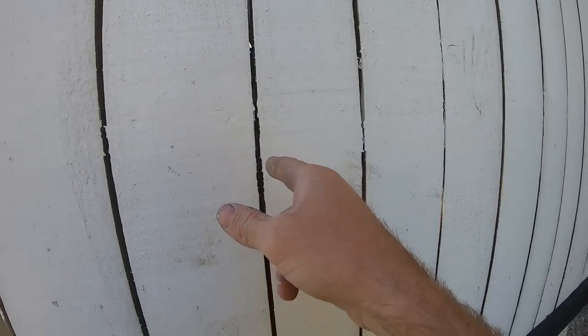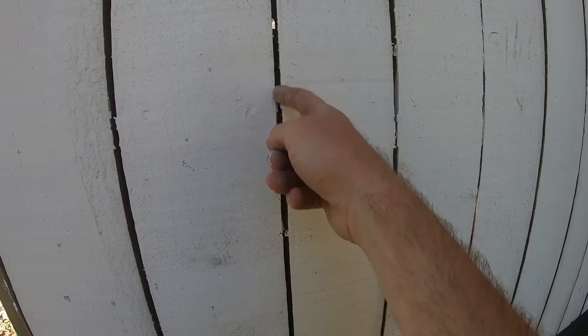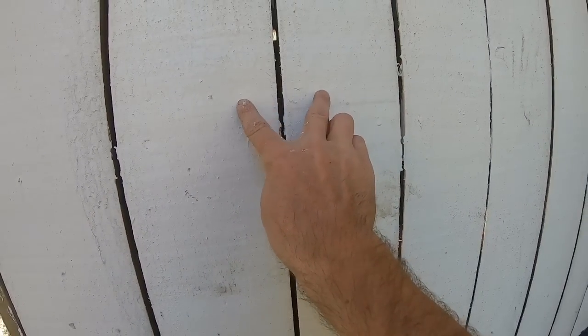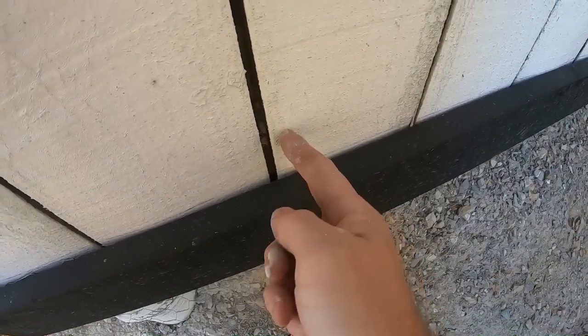So I'm going to take a 4-inch screw, run through the batten strip, right in the crack, not hit either board, and then hit that purlin. And that'll really pull it tight to there and keep it independent of those boards, whatever they decide they want to do. We might still have to slap one in one of the edges down here to keep it from twisting on us. We'll try. We'll see what happens.